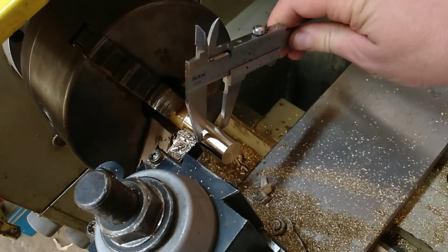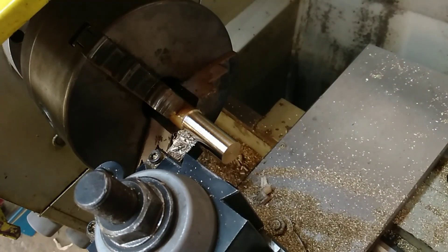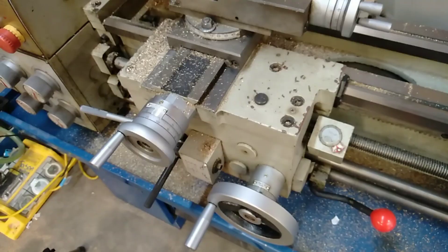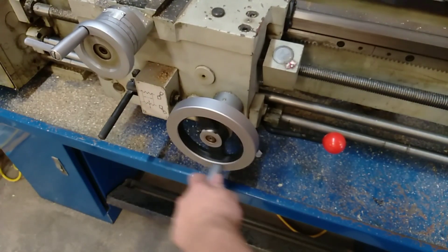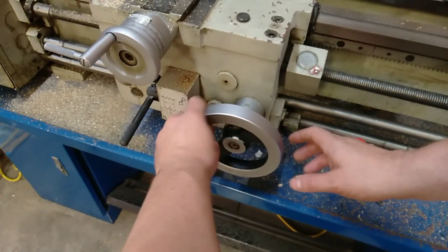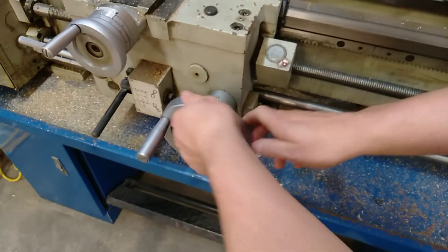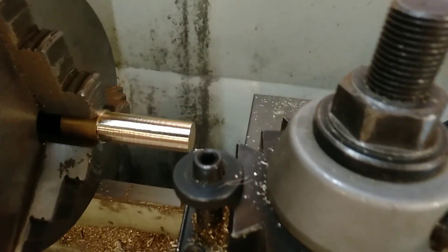Checking that again — it's not quite there. If I put it over the end I can tell there's just a little bit more to go. To make it easier to cut and get a nice smooth fit, instead of using one hand, we can use two hands and go what's called hand over hand. That makes it easy to get a smoother motion and you don't end up getting ridges in your cut work.